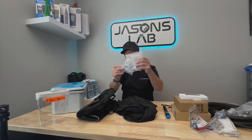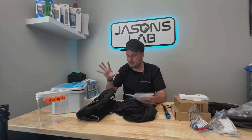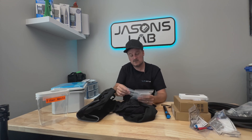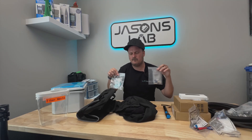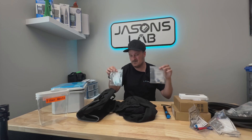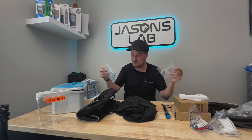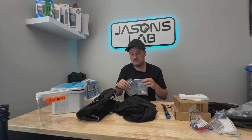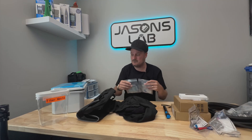I got some mechanical ends because I asked Tom — I really want to show people that you don't need to buy a whole pile of expensive equipment just to do maybe one or a couple of runs. Tom sponsored me some mechanical ends. Some people might say you need a fusion splicer, but if you're doing a 1 gig connection and not that far of a distance, this will work just fine. Do it properly, test it properly, and it should work. I have a cable outside right now that's been in the weather for two years with mechanical ends — some cheap Amazon ones — and it's been working just fine.